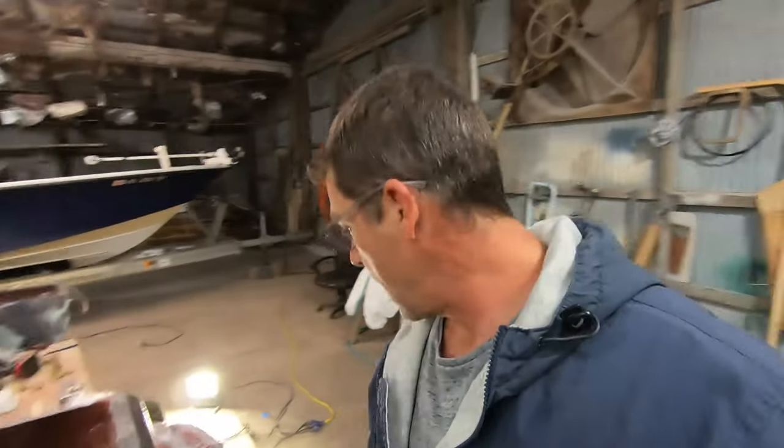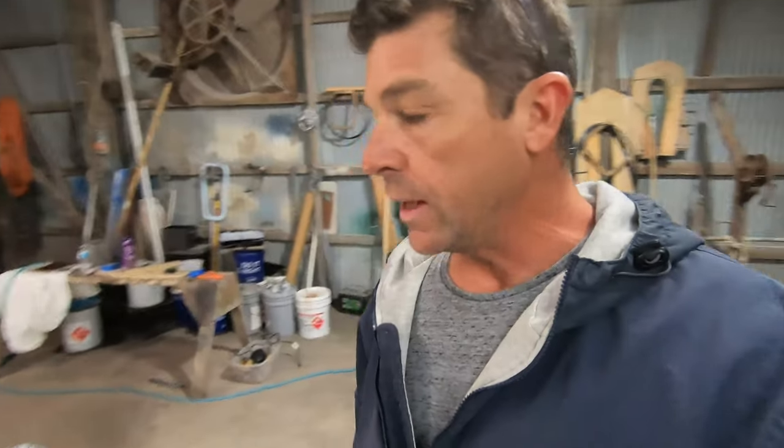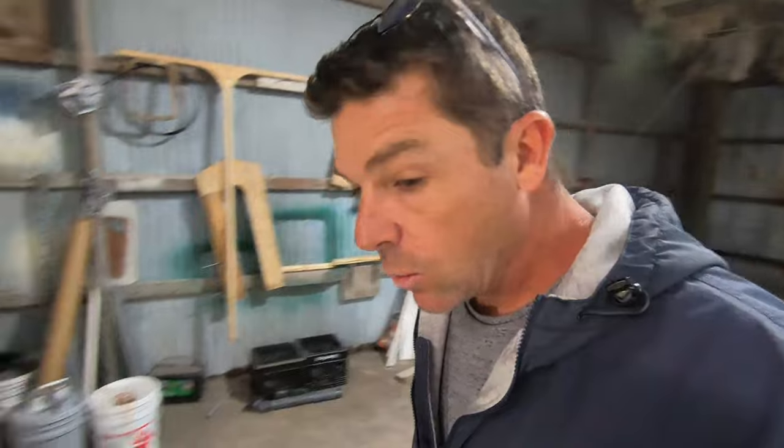Zoom in there. All right, y'all, using the vacuum has been a big trick. If you're not using a vacuum when you're sawing or cutting fiberglass, especially in confined spaces, that's how a lot of times we get away with not wearing a mask. Either way, we've got air moving. I'm going to go ahead and unplug her there, Mark. The only bad thing about a vacuum is the noise. It'll kind of wear on you.